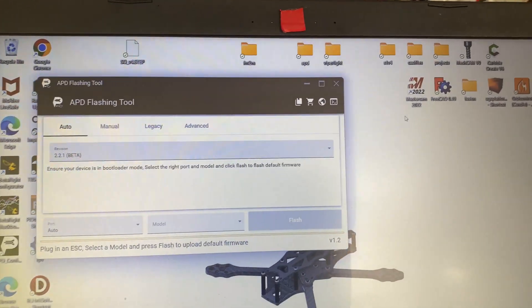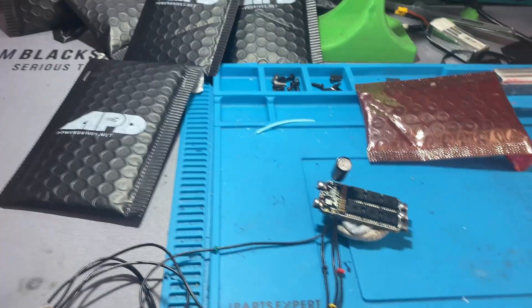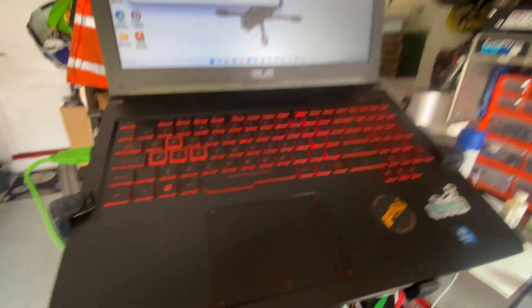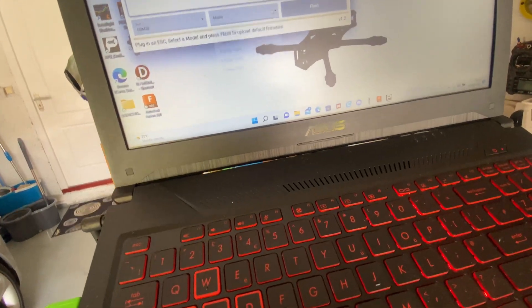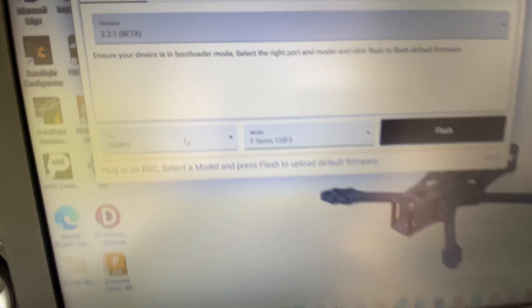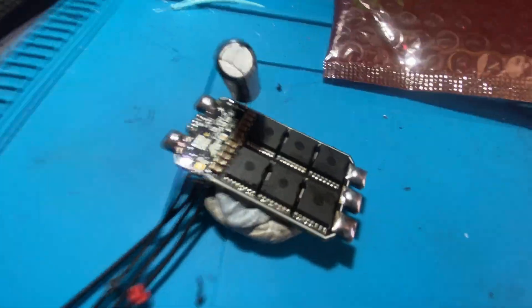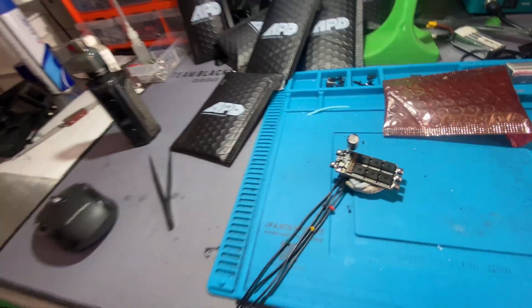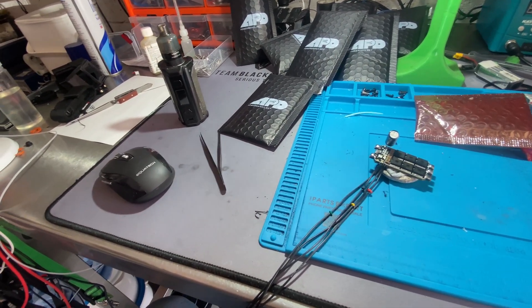This is the latest flashing tool. What I'm going to do is bridge those two pins with my right hand and while I'm holding those, jam that plug in. So what you have to do is configure the model: 120M communication and we're going for the latest build, 2.2.1 — that's what's needed for Betaflight 4.3. This is not in bootloader mode because it's flashing. So when I bridge the pins and plug in, it'll be a dim light.